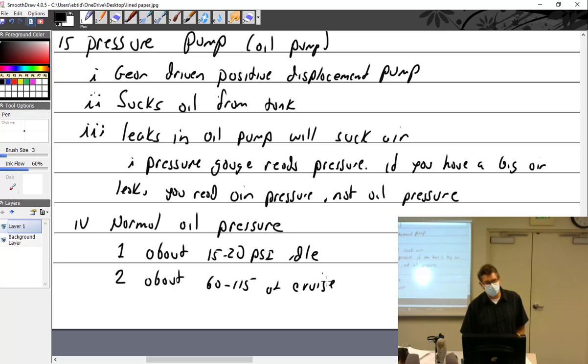In fact, part of doing an annual inspection, the first time I do one on an aircraft I'm not familiar with, is I get out the pilot operating handbook, POH, go to placards, and verify every single one. It says in the pilot operating handbook, green arc, oil temp between this and this, and I go, yep, that's correct. You'd be surprised how many times it's completely wrong. Say, tach, redline in here. I'm like, that's not right. People just put in stuff, you know?